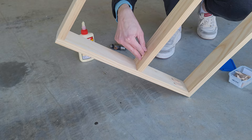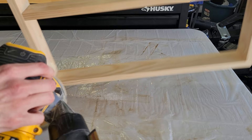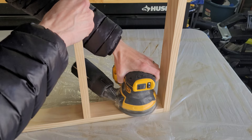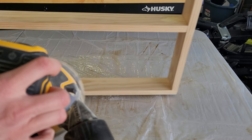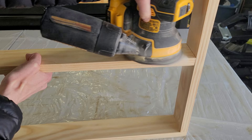I plugged my pocket holes, and once the glue dried I used a multi-tool to cut them flush with the wood. Then use an orbital sander, palm sander, or sanding block to sand the plug spots smooth. After cutting the plugs, I added some wood filler to any spots I wanted nice and smooth. I have wood filler that dries pretty quickly, but I did go ahead and wait 24 hours. Once it's dry, sand it all and then take a rag to fully clean it.